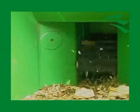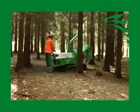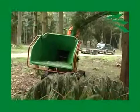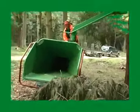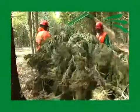The 220 SafeTrak is a 9-inch machine fitted with a 55 horsepower 4-cylinder engine, which can really blow the wood chips. This machine exerts a ground pressure of only 0.27 kilograms per square centimetre, and with the SafeTrak system, can access the most difficult of working areas with apparent ease.